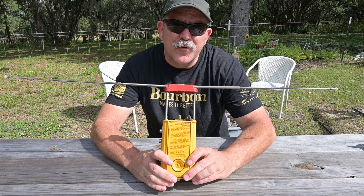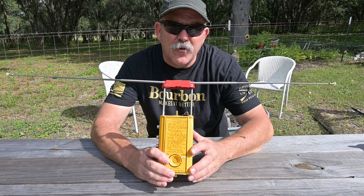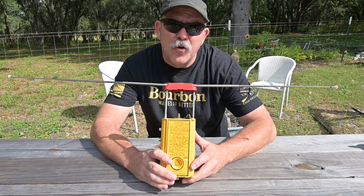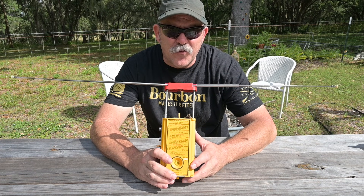At a weight of 6 pounds with the tethered mercury battery, which is almost the same dimensions as the radio, it covers 121.5 MHz and 243 MHz in AM mode with an output of 35 mW. This was intended as a survival radio for a downed airman.